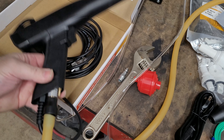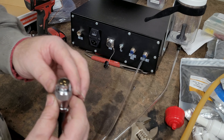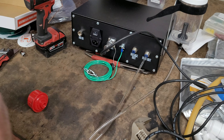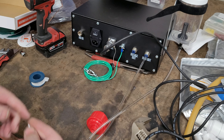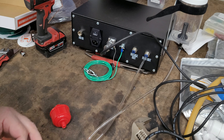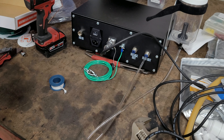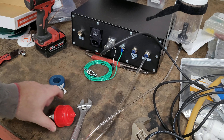It went on the gun barb a whole lot easier than the rest of them. I'm wondering if I'll need a hose clamp down here. This is a keyed fitting — you can see all these tabs — so it will only go in one way. I'm going to set this up the way it's pictured in the book: filter first, then quick disconnect. That filter is probably not going to last very long, but luckily I have a dryer on my shop air so it shouldn't be an issue. You don't really have to worry about restricting airflow on a system that's only going to run 30 PSI, but you still don't want to plug the thing up. I'm going to go ahead and throw some Teflon on here too.